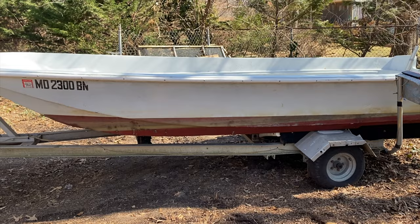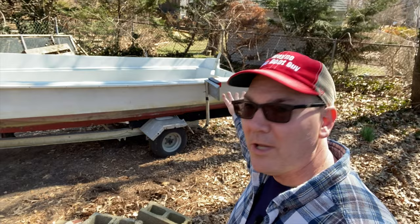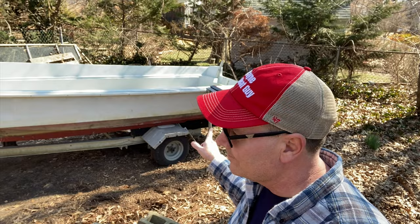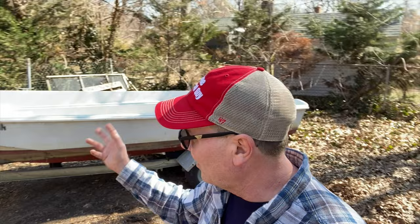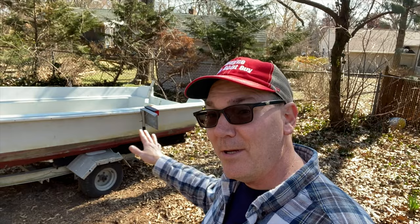The way we're supposed to do this is you've got to lower the bow of the boat — disconnect it from the truck and have it as low as possible in the front. That way the back is up high; build platforms to hold the back of the boat up, then bring up the bow so it's resting on those and not the bunks. Then block the back, drive the trailer forward a little ways, block it midway, drive the trailer farther forward, then block the bow.